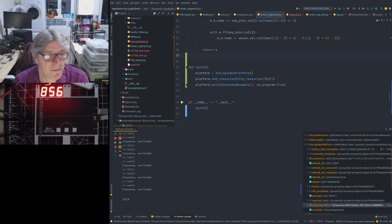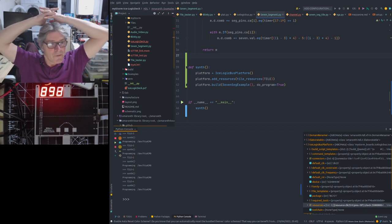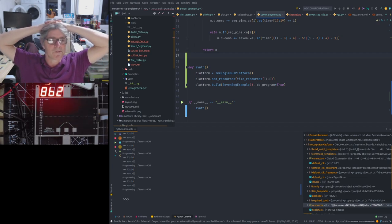And you'd have, effectively, if you did the triple, you would have 3x6 FPGA IOs. So you'd have 18 IOs. And you'd have three mixed signal pins from the STM32 in this case, if you so wished. Or if you did a double, you'd have 12 FPGA IOs and two mixed signals. So I mean, that would be good if you wanted to say do a camera, an FPC camera connector. That'd be perfect.